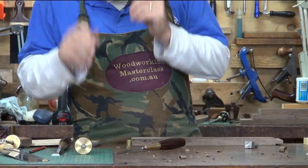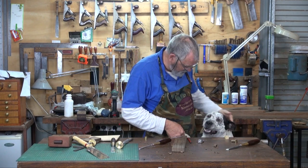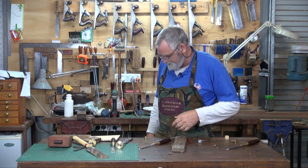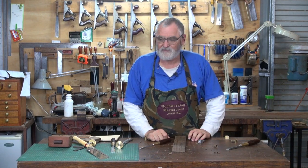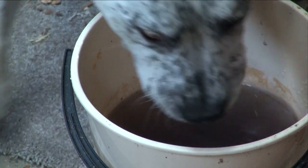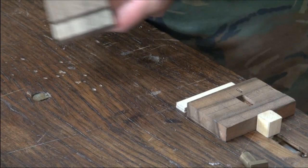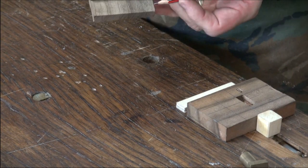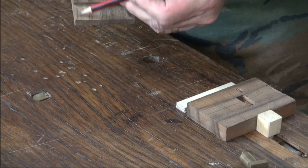So let me get a marking gauge. I've marked out the cut lines. I'm going to come in off the shoulder here — that's going to be waste, that's going to be waste, and that's going to be waste. Several ways I could do it: I could put it in the vice, grab a coping saw, cut down, cut across, get rid of the waste, then clean it up with a chisel. Same on the side — I can just cut down there with a Japanese saw or a back saw. But sometimes I'm not the best at sawing, and I know I've got more control over a chisel.